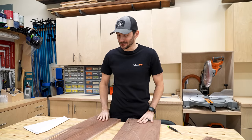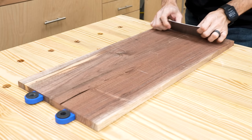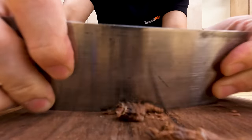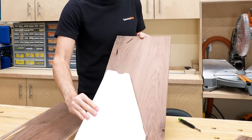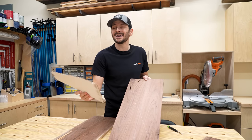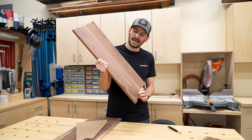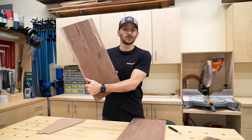The panels turned out great, and I just knocked down the seam with a little card scraper — that is satisfying. You might be thinking, 'Hey Brad, I didn't see you glue up that second long panel.' And you'd be right, because this is the shape for the side, and because it's angled, I thought I could just turn it around and fit two just like that. That was all great until I realized that would give me two left sides and not a right side. The back of this is kind of nasty and I didn't want to use it, so I had to glue up another panel.